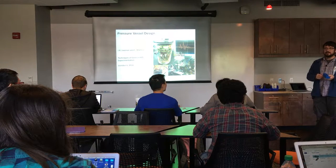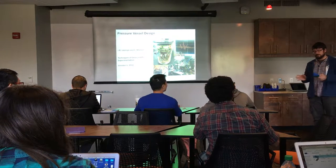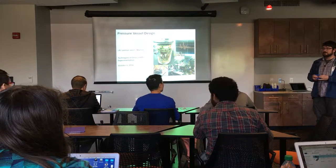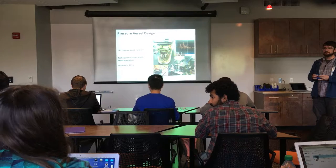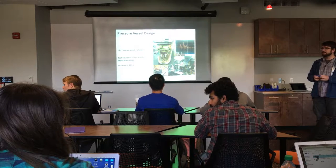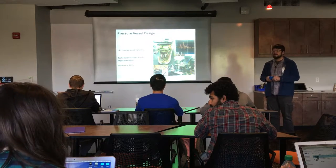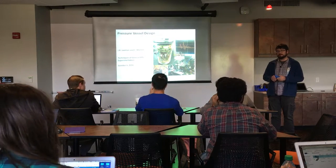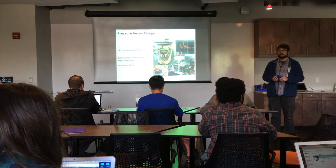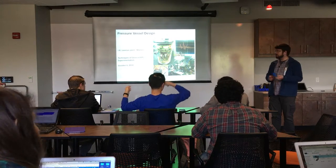Carrie's part came back and you can see through parts of it — the infill is so low. Go at least 10–15% infill, and if they give you too much trouble about it, let us know. Because it's a core project, apparently you can ask for whatever you want. Anything over probably 40% is not useful, but 30% is a pretty good number for hard parts — so somewhere in there. If you have any other problems, let us know.